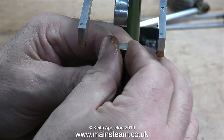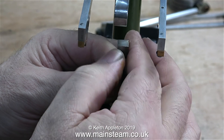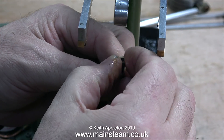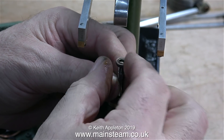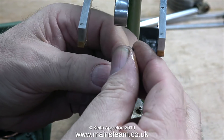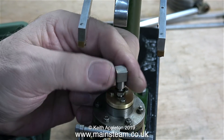For me, fitting Watt's parallel motion is often a problem — it's a little bit like wrestling an octopus. The first thing I have to do is dismantle the parallel motion so that I can fit this part to the top of the piston rod. When I try it in position I realize it needs a nut underneath it, so here's the nut going in place. This is a lock nut which will stop the piston rod from coming loose — even this is quite a fiddly job.